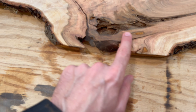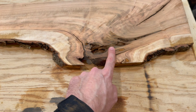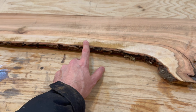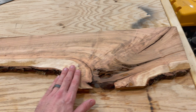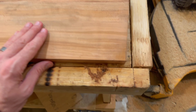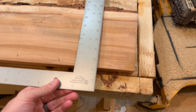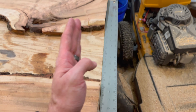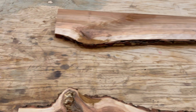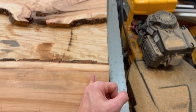Some of these areas turned out really well and I don't want to mess too much because it's really pretty thin. The hole through here is kind of fun and it'll torch up nice. Other little areas that didn't quite sand down we'll hit with the hand sander. I also notice I need to go out and square up the edges — I can tell by lining up against a square piece that it's not square. Once the ends are lined up I'll set this piece on top of the other and align them.